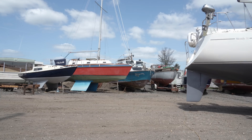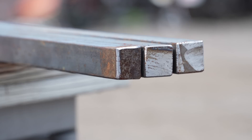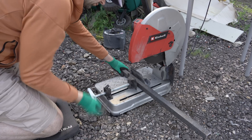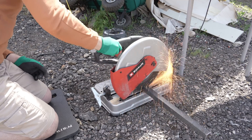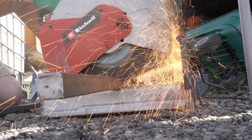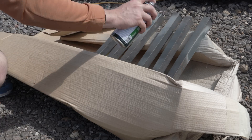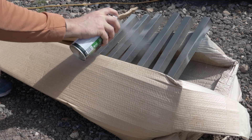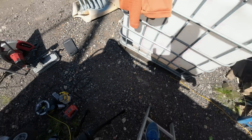The angle grinder won't suffice — it means the return of the proper metal cutter. All the steel is of basic non-stainless variety due to cost, and the square rod is uncoated, whereas those old chicken farm flat bars are galvanised. These cut ends have been left out in the rain for months and are only showing vague signs of it, but will find a more lasting protection after I've made the cuts. I had a rough idea of how many bars of various lengths I needed, but a lot was going to depend on how they actually slotted into the empty space. Most were 2 or 3 kilos, and even with this compromised mini void to fill, I'm hoping to get a good 40 or 50 kilos under there and another 20 or 30 on top. The zone will be sealed and water shouldn't collect, but to avoid rusty stains I zinc-coated the steel bars. This is no substitute for hot-dip galvanising, but a 98% zinc content paint dries super fast in the summer sun and will provide at least some delay to corrosion.